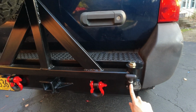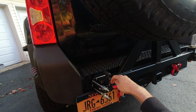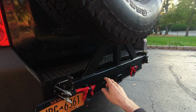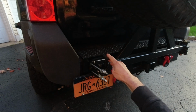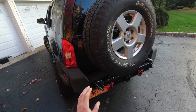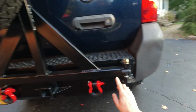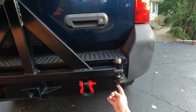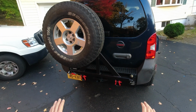So I found on Amazon almost the same design, and I just welded it in here. I cut a hole through it, I welded this in place, and over here and on that one I put the thread locker, so this is not gonna go anywhere and it locks in there pretty tight. So to operate this is pretty easy. All we have to do is unlock this latch, and over here actually as well, when this is in a lock position, I measured over here and I drilled a hole, so this is locked in here as well. So now I have almost like a double lock.